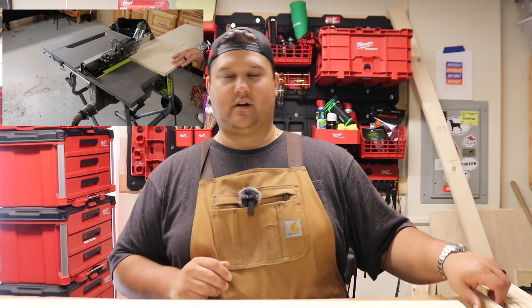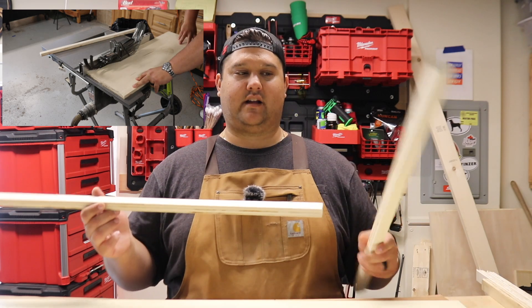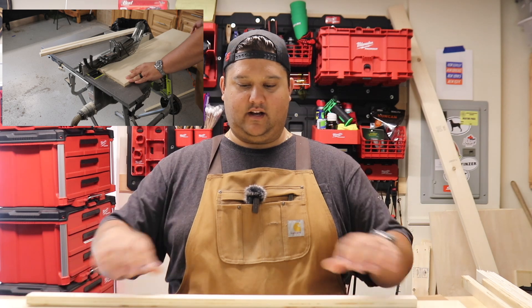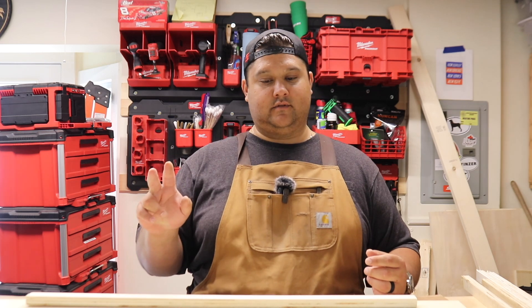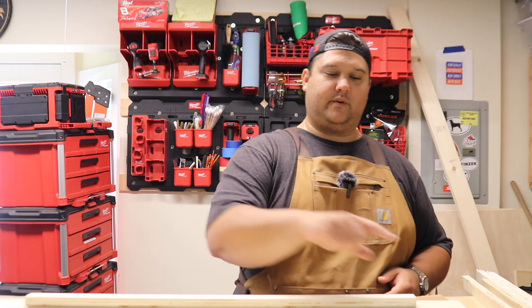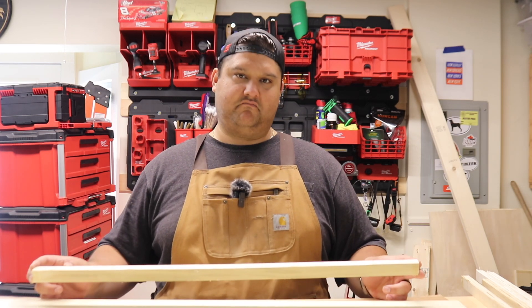Just like that we've got our backing piece painted the same color that will match the wall. While this was drying I went over to the table saw and cut a bunch of one-inch strips. I don't actually need this to be one solid piece — there's nothing structural about it. What I'm going to do is basically create an inner frame on the back portion of this piece so that it will stand off a little bit from the wall. That's going to serve two purposes: one is cable management, and two is a bit of a surprise. I'm thinking about two to two-and-a-half inches of clearance all the way around, with a pin nailer and some glue to get these on there.